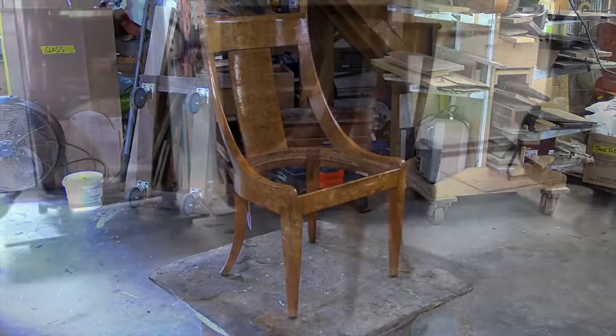Alright, for the first coat, I'm going to seal this with shellac. I anticipate that there may be problems with this finish. In other words, we know that the top has got some kind of gunk in it that turns up on the sandpaper. Different contaminants can cause problems with surface tension, which makes the finish not flow out smoothly, craters and stuff. So sometimes a coat of shellac might help.